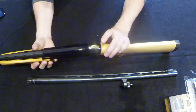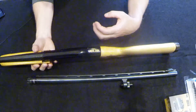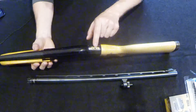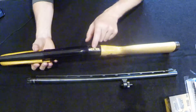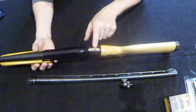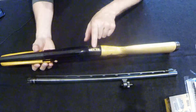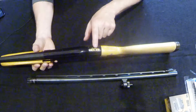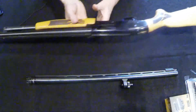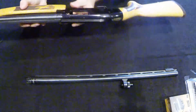The first thing I did to this firearm years ago was replace the tang safety. The original one was plastic — it cracked and allowed the mechanism inside to pivot, so you could not take the safety off. I went and machined a small one out of brass. Now online you can find them all over the place in billet aluminum. If you have a plastic one, take it off, throw it away, and put one of the new metal ones on. When the shot counts, the last thing you want is for that safety not to work.